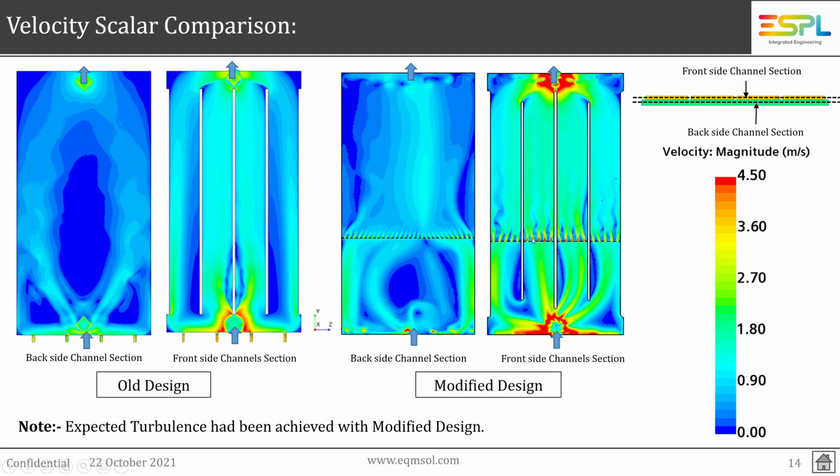pockets, and if they are so narrow, the aluminum will even out the temperatures there better. If you have big pockets like this, it will get very hot, and it doesn't matter even if on the other side there's nice airflow. The basic idea is that top side and underside airflow will even out the results of the simulation. So it shouldn't have pockets on either side of the air.